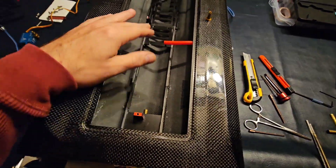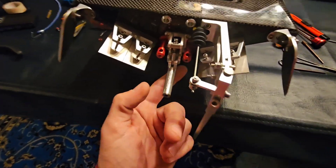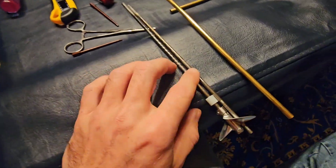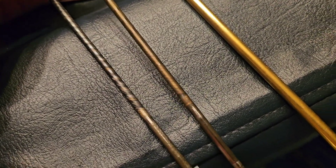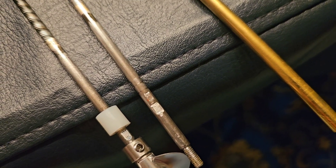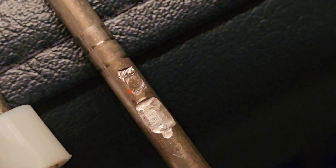I have got the entire assembly out of the Dominator. The next thing I'll be doing is removing the rear bearing drive. I wanted to show you this — this here is the flex cable that originally comes in the Dominator, and it already comes with the flats on the end. You can tell the original flat was there, and then I ground another one below it.